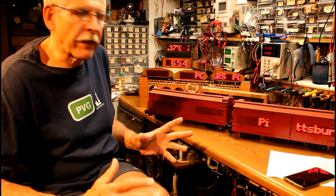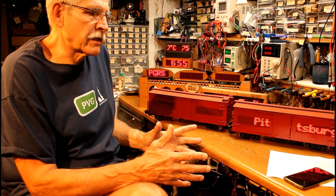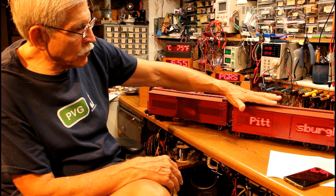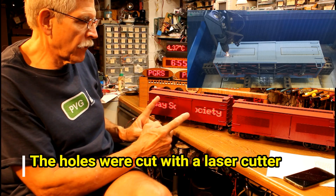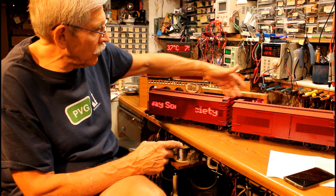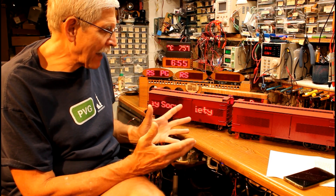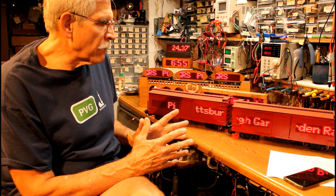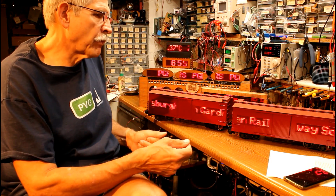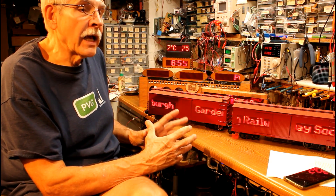The static sign did get people's attention, but because it stays in one place it's not as noticeable as it could be. I thought it'd be a great idea to put the display onto moving cars, so I took two boxcars and cut holes in them for the four-unit LED modules — one, two, three, four on the front, and four on the back too. That way, no matter where the train is on the layout — going towards you or away from you — you'll still see the message. The frustrating part is that to change the message you'd have to disconnect it, go to a computer, plug in a USB, edit your file in the Arduino IDE, and then reprogram it.